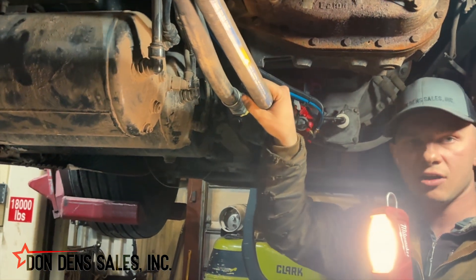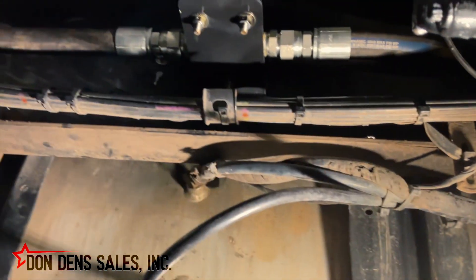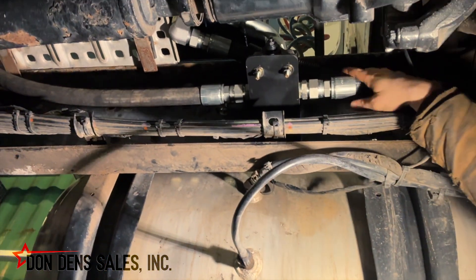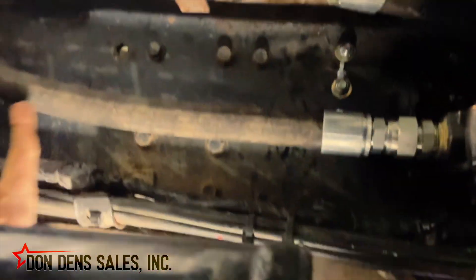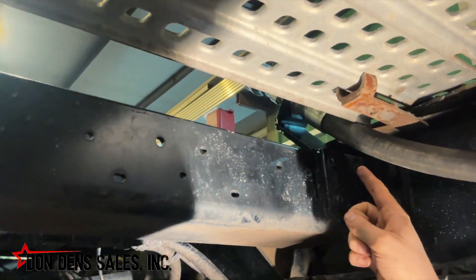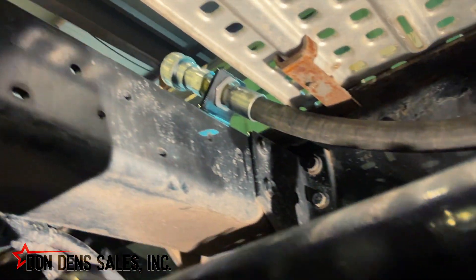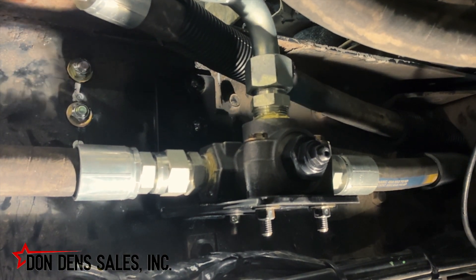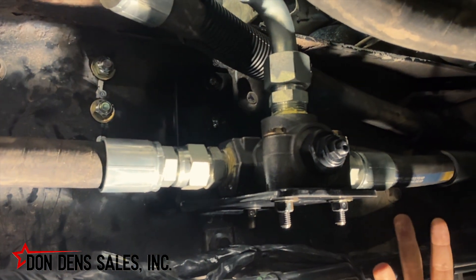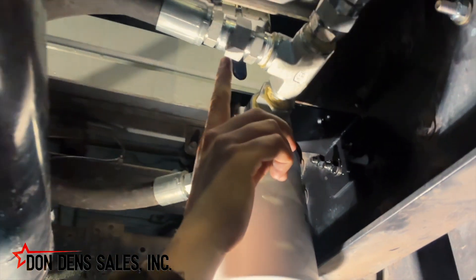Running that fluid through the pump and sending it out the pressure side, which goes back down the truck. The first thing this pressure line runs into is your pressure relief valve. There are essentially three pieces to this pressure relief valve — the inlet coming from the pump, the throughput going out along the back of the truck, and finally out to our pressure side connector bulkhead which goes to the walking floor trailer. If your trailer is not connected and you engage the PTO, it's going to dead-head at that bulkhead, build up pressure, and this pressure relief valve will kick over and send fluid out of its relief port, which tees into the return side.